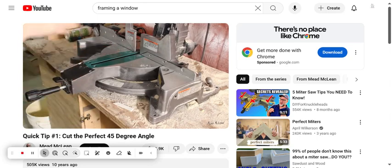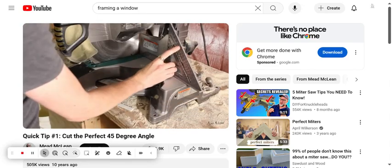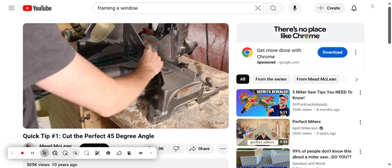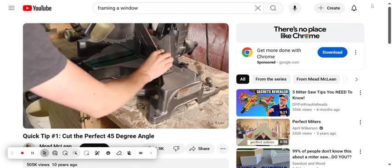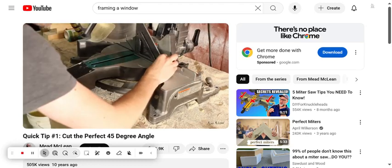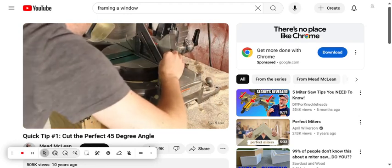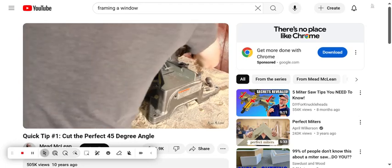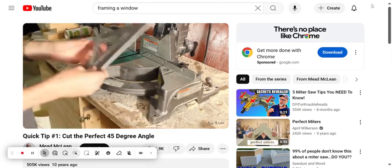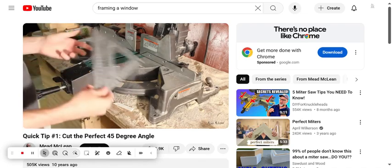And that starts with, if you have a double bevel blade, you're gonna make sure that you're right at 90 degrees and all lined up. See that mine is just slightly off — I'm going to readjust that. This speed square is a pretty handy dandy tool, and you're gonna use it to line up all your cuts.